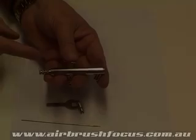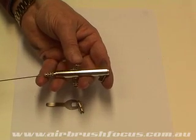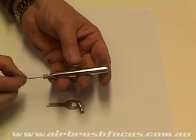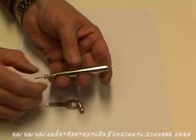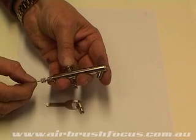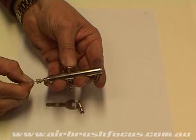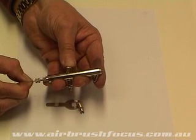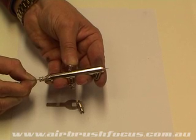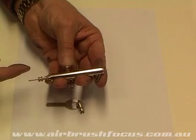The reason for putting the assembly back together again is so that I wanted you to understand that if the needle bearing is too tight, that when you pull back on the trigger and let go, the actual needle won't return. It'll actually stay back. Instead of going forward, it'll actually stay back here. And it's very important that the needle is going to move correctly backwards and forwards.